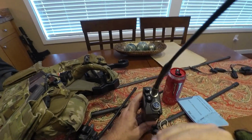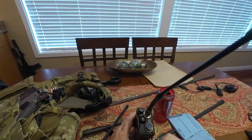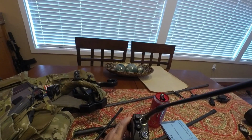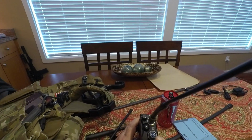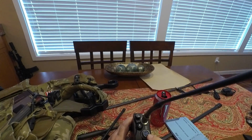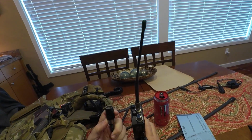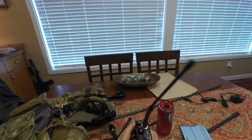Okay, 6-pin ground, not grounded, but ground meaning ground applications. Somebody a long time ago decided on 6-pin, because the PRC-25 in Nam had 6-pin on top. Somebody decided that this was going to be a good deal. All these little brass things are called pins. They are actually little mini hot shoes, and they transmit data back and forth, RF energy, whatever you want to call it, to corresponding receivers inside connectors for your various audio devices, whether it be an H250 dogbone hand mic or high-speed push-to-talk handsets.